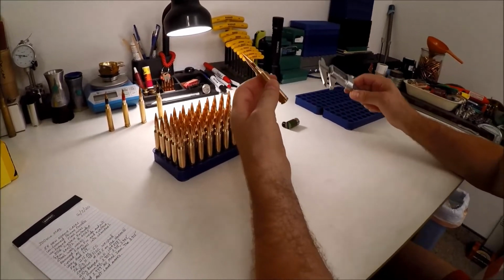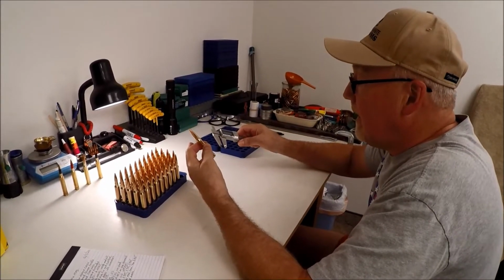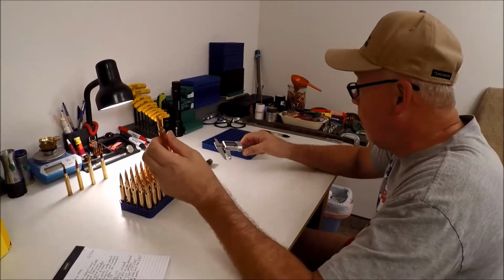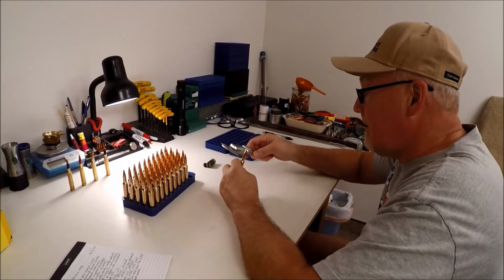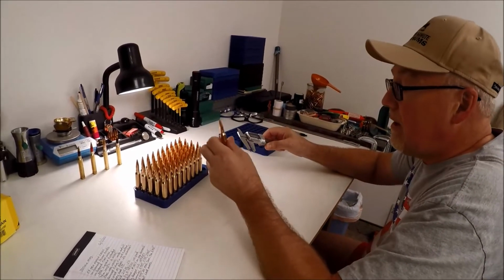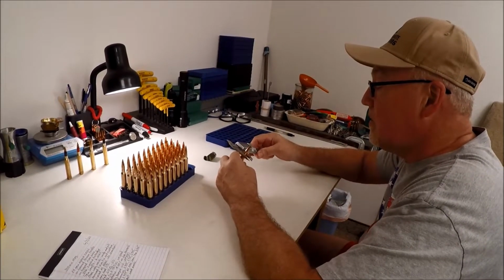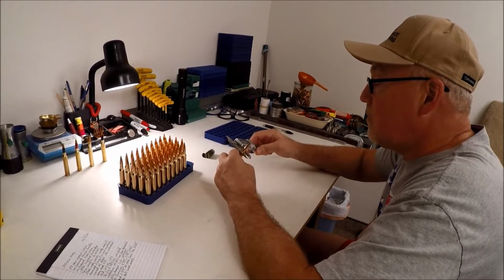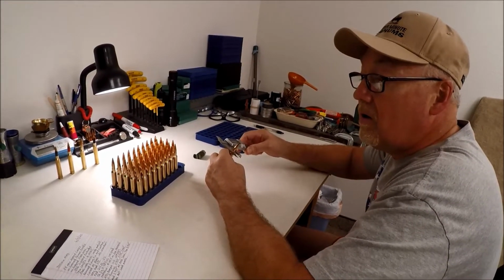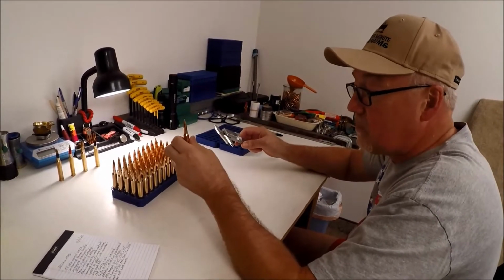You could have a reamer print, which you won't on a factory gun. You could use Cerrosafe and take a chamber cast, which is a pain in the butt. Or when you fire these, in other words, measure these as they are now, right? You're going to fire them in the gun. Whatever they come out of the gun, measure it, and you can assume that the actual neck in the chamber is within one or two thou bigger than whatever your fired piece of brass will be.